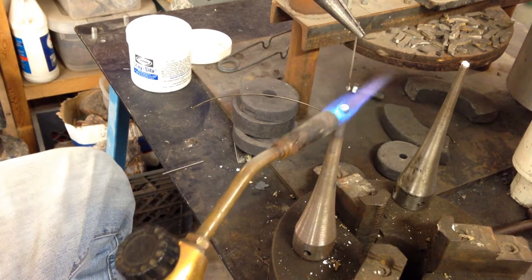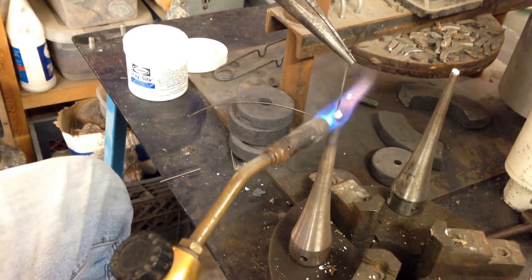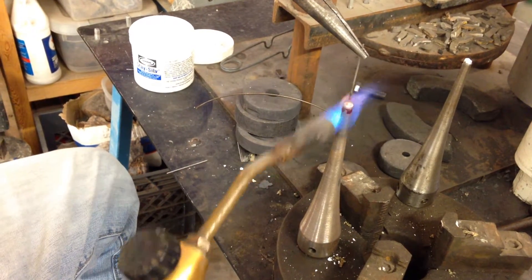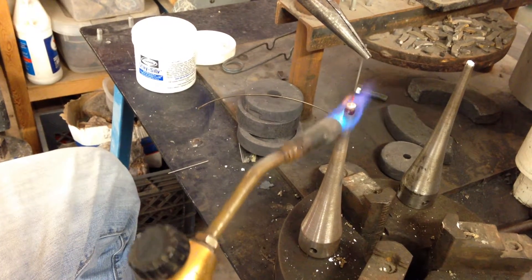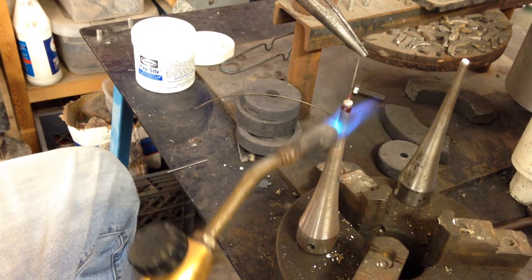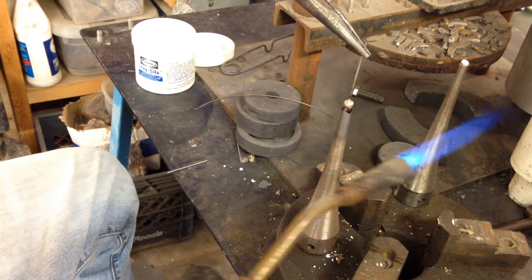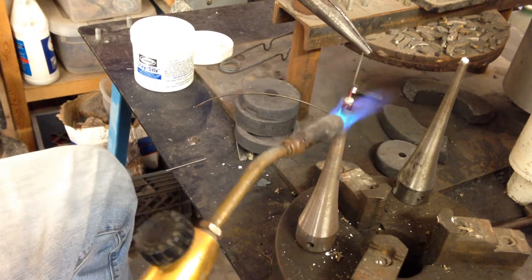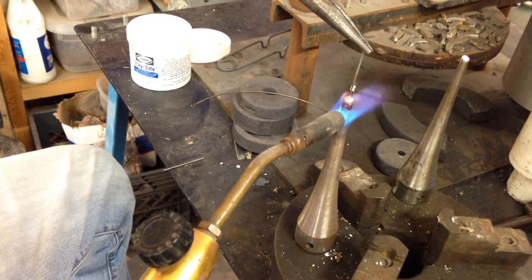The propane is a little bit slower. You've got to really watch the heat on that pin and keep most of the heat on the horn. If you don't get your pin straight, just heat the horn back up. You don't really want to bend your pin at the bottom.